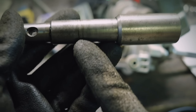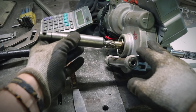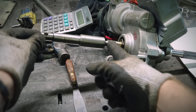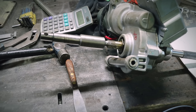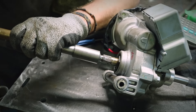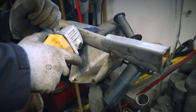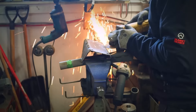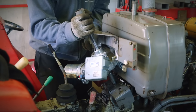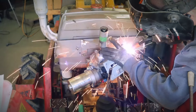This is the bottom section of the steering column that I just cut. I machined and pressed in a coupler, and bored that side to fit the power steering. I'll gently tappy-tap-tap this side to be slightly pressed in halfway, and then put some tacks around the shaft too. On this side I'll do exactly the same thing. Here I'm putting temporary braces to the bottom and top section, which I will eventually have to join together somehow.